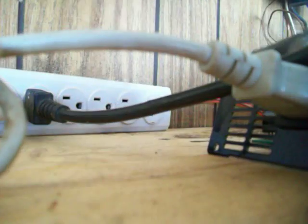What I'm going to do is turn on this fluorescent and then unplug the incandescent. Now you can see that the little fluorescent burning up here is pulling the whole 11 watts. So if I turn on my grid tie inverter, it takes the watt meter back to zero. And the power builds back up on my battery bank.